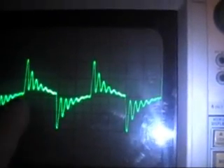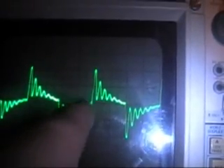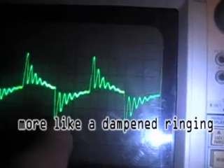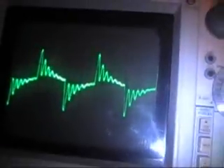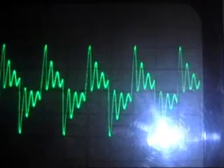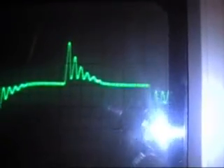To get this to resonate: these are the edges of the square wave pulse going in. When the square wave hits, you get the oscillation at the top and at the bottom of the pulse every time the pulse changes. We're going to increase the frequency until we get to where the bounces are largest. As I increase the frequency you can see these pulses start consuming each other — that's as far as I can go on that range.